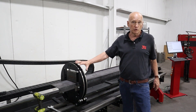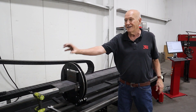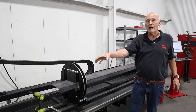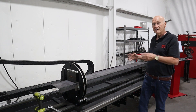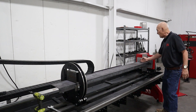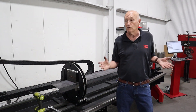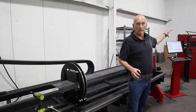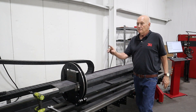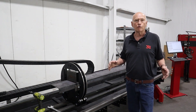That's where stabilizers come in. I'm actually designing a new one to handle up to 12-inch c-channel specifically — the idea is to cut the steps in stairs, cutting in sections of maybe three feet at a time. Using a stabilizer is a great solution for that — you cut three feet, move down, cut another one. But if you try to use a stabilizer to do a long part and you run it all the way back, you've got a giant hunk of channel hanging down and it's going to bust the stabilizer. That's also why I like traveling-head machines — the leverage effect on a fixed-head machine is overwhelming, it'll just crush your machine.